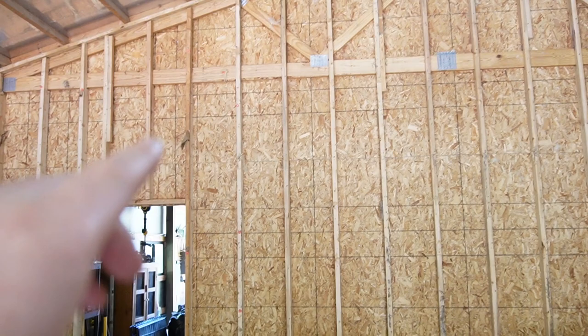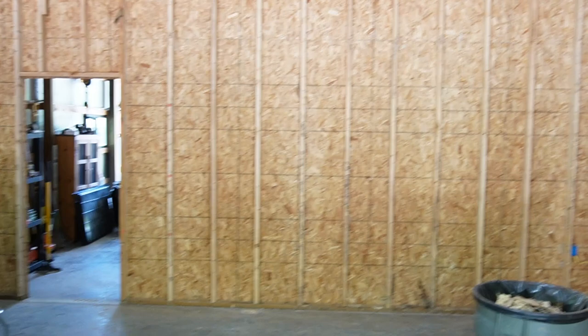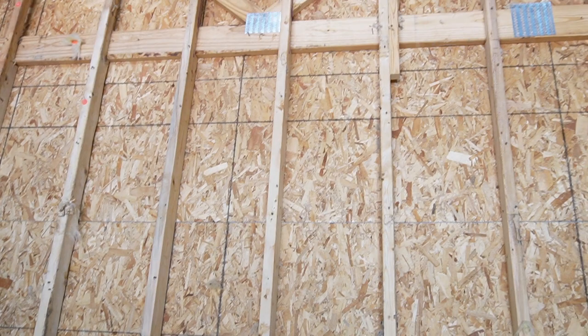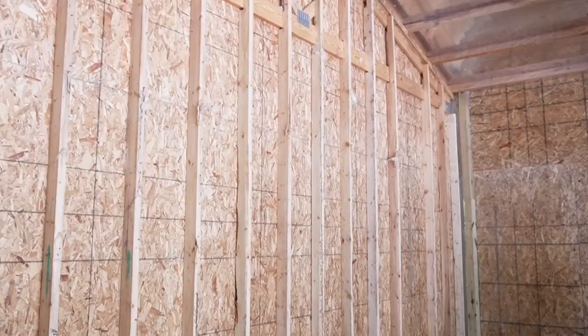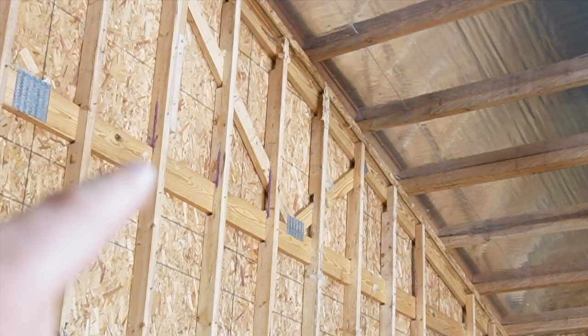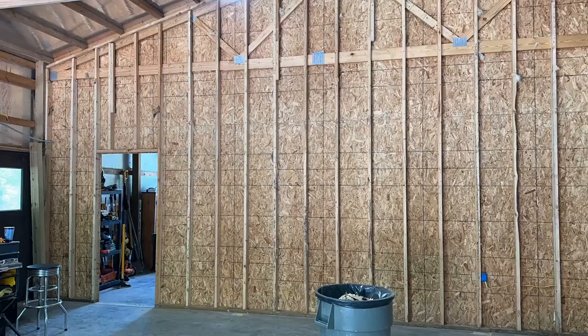I got this whole bulkhead all of the OSB ripped off. I wanted to try to save as much of it as I could but there was termite damage and I had to basically rip the nail heads through the OSB, which pretty much destroyed it. Right here they pretty much destroyed that stud, and the one next to it is also pretty bad off. Luckily the truss for the barn is still in really good shape — it hasn't been touched by termites, so that is good. Being the way I am, I think I'm going to end up ripping all this out because the wall isn't quite perfectly level and the way they notched it out up top around the truss is very inconsistent, so I'm probably just going to start fresh and do it right.